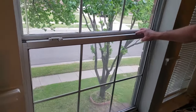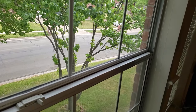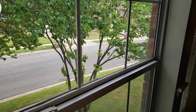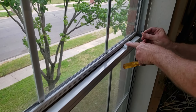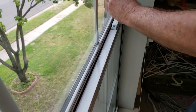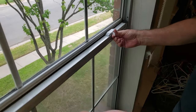As we said at the beginning, we've got to replace what's called a sash lock. You never want to use these to open the window because they'll break off — and that's what happened here. You can go to a local hardware store or get it off the internet. Make sure the size is the same — always take the broken one in with you. We want this on the outside, so we'll open the lock up, put the screws in, and then make sure it locks. Both locked.